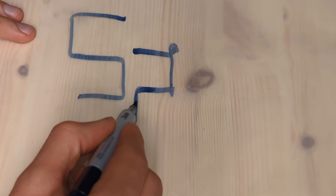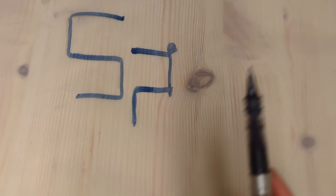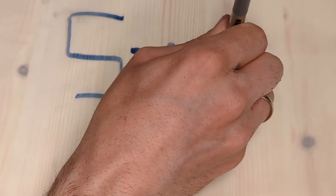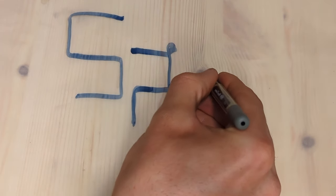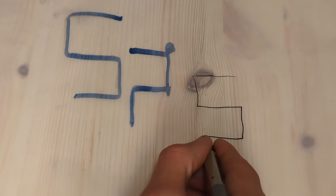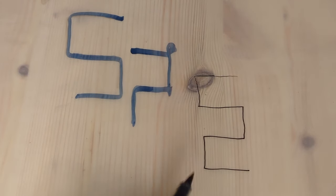But the issue on the inner edges still remains because you can't do extra movements there, so those would need to be fixed by hand. Now let's look at the tip of a laser — a laser is very thin; in some instances the laser will be thinner than a human hair. I'll use a thin marker to represent the laser here, and as you can see I am able to cut very sharp corners, and that allows me to use traditional wood joints.